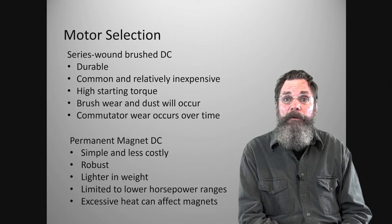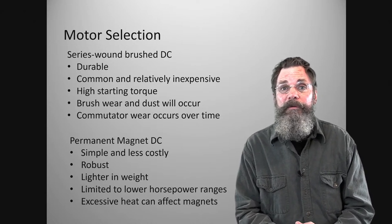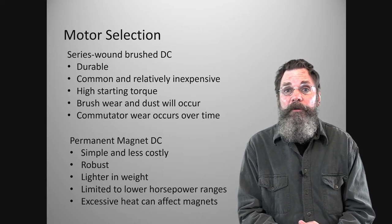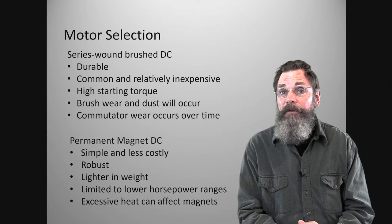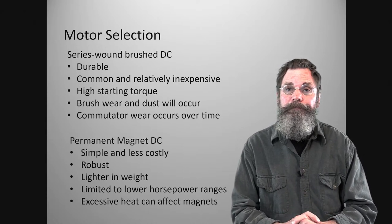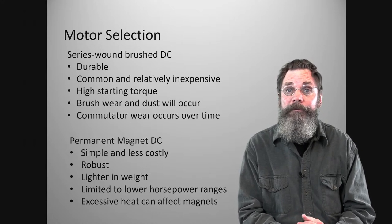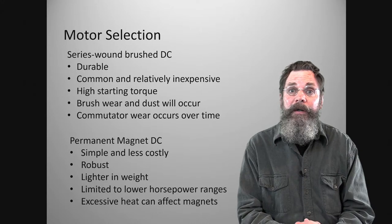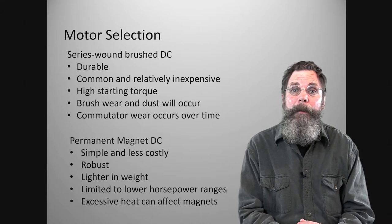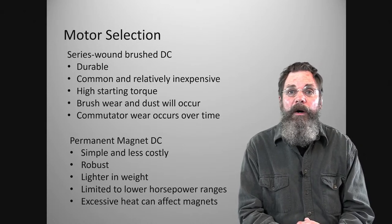So we're running ours at 48 volts. The higher the voltage, the more efficient the operation is. It could be run at 24, it could be run at 36, it could be run at 60. That will also depend on the fitting of the batteries, really the physical ability of you being able to fit a certain size battery into the space available. And also, of course, the cost.